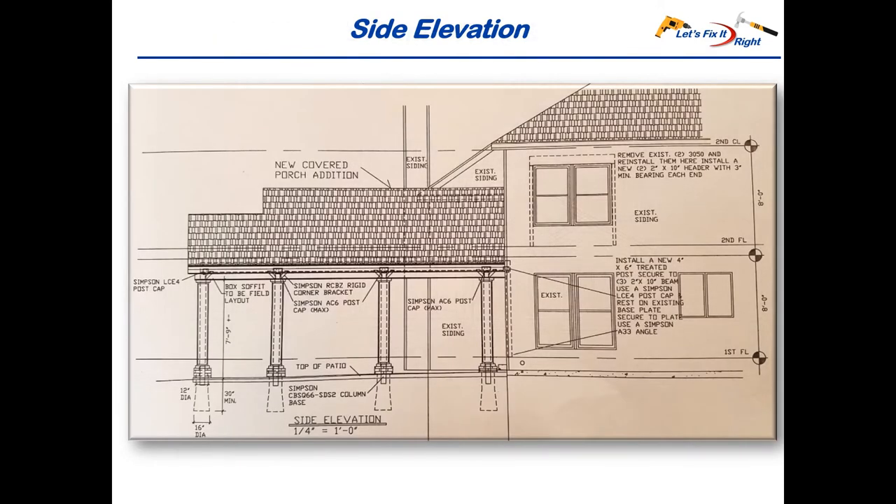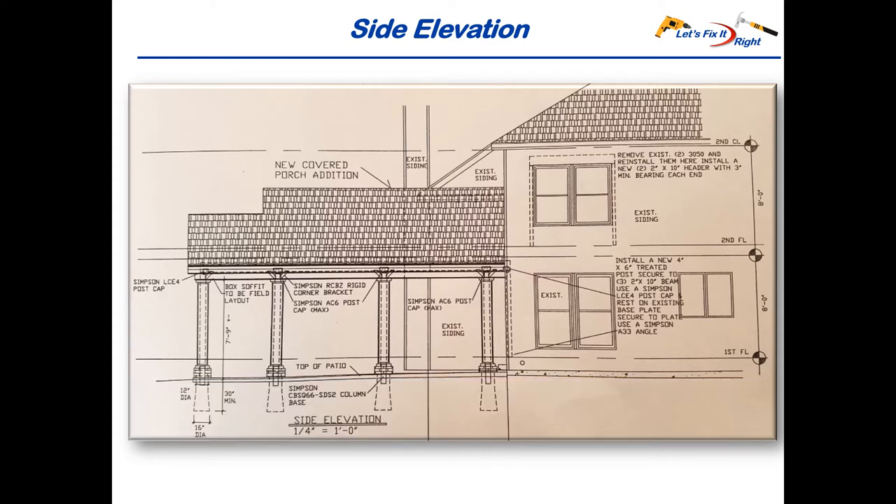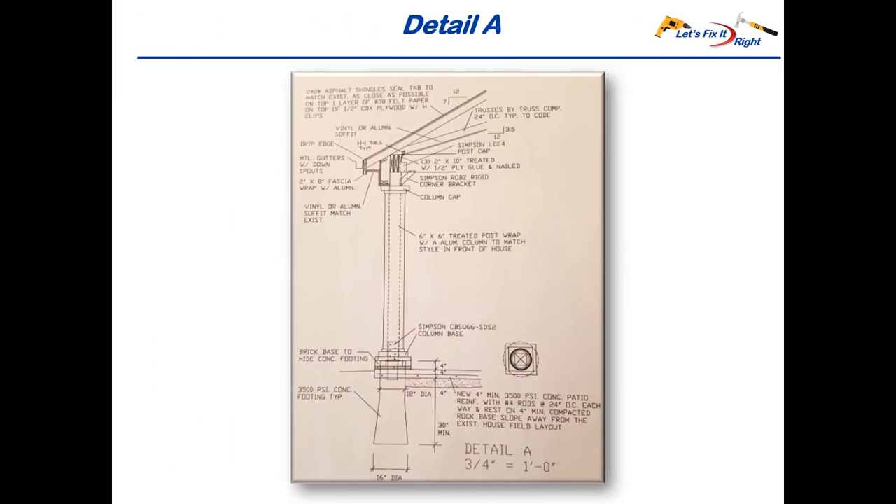This is the side elevation of the patio structure, showing its changes to the existing design of the house from a side perspective. It shows these four columns, their aluminum wraps, and several Simpson ties. Later in this episode, I will explain in detail what these Simpson ties are and why they are important. This is the roof line of the new patio from the side elevation and its overall impact on my home's appearance. In addition, it shows the gradual downward slope of the patio concrete and pier tops to ensure that all water flows away from my house and foundation.